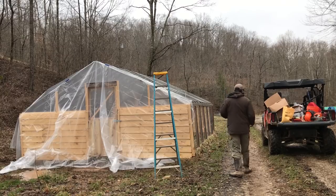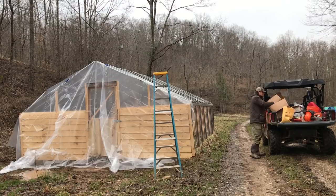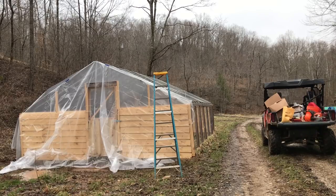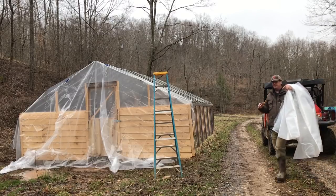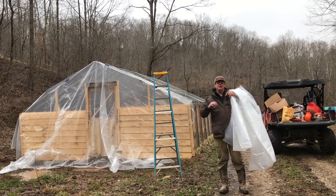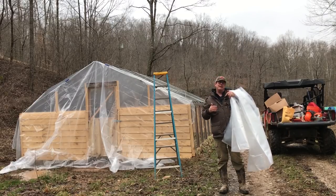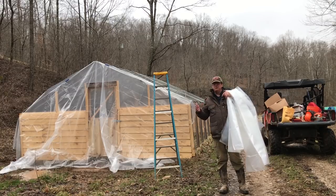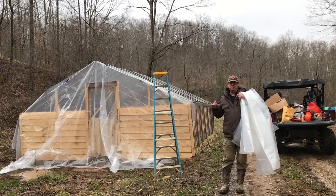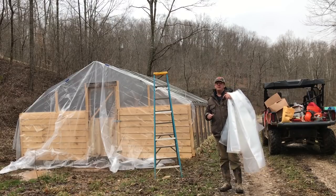And I ordered our plastic a while back, actually, because I've been working on this project. It is greenhouse plastic. You can see some here on the ground. We ordered specifically greenhouse plastic, and the difference between that and what you get at the box store is the UV coating. So this plastic has a UV coating on it that helps it from breaking down from the sun. It's my understanding if you use box store plastic, the typical plastic, it's not going to last very long at all. The sun's going to bake it, it's going to get crunchy and fall apart. So we ordered this. I'll link below where we ordered it from.